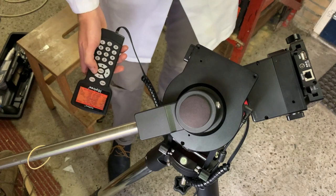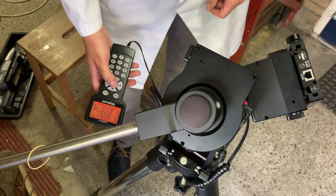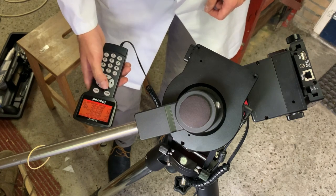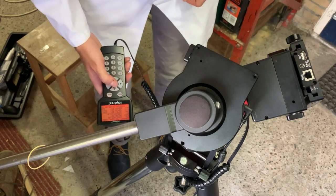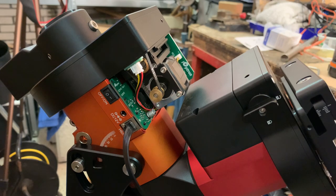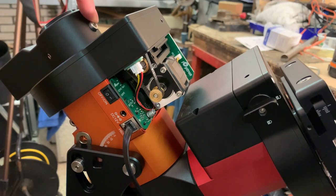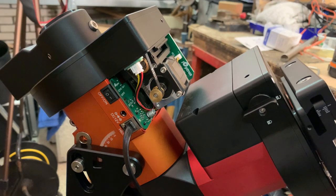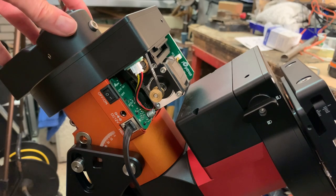I think I would like to see it more up close, but then I will have to open it up even further. I'll do that, but first I need to prep some stuff — and to do that we need to release these little grub screws. This big one over here, and on the other one there's another grub screw, then the entire counterweight mounting will be able to come off.